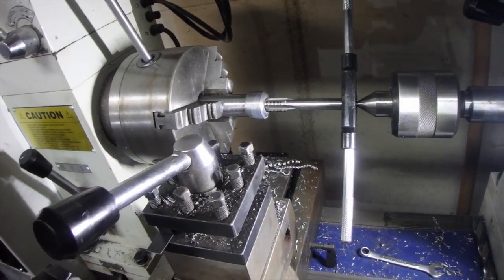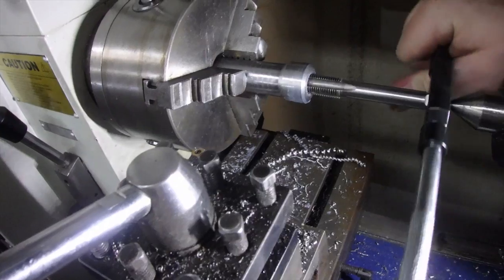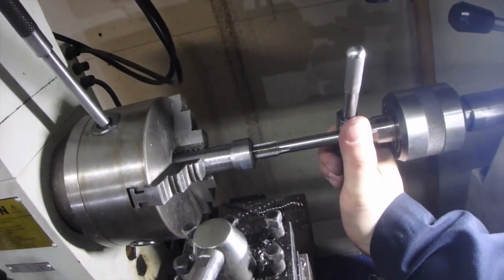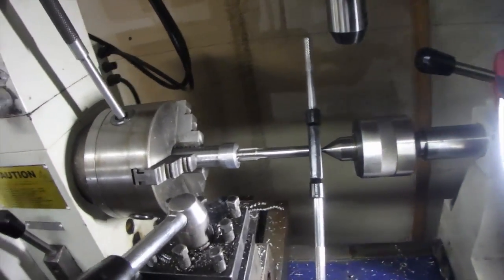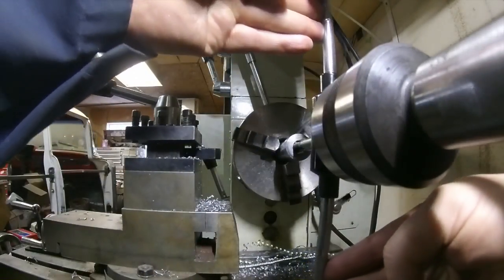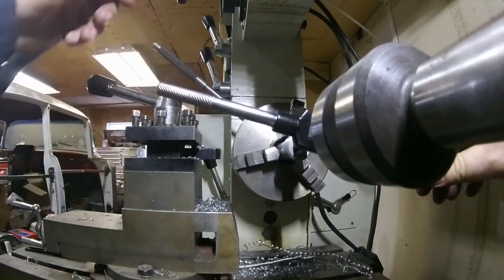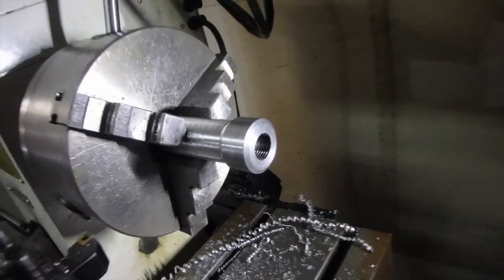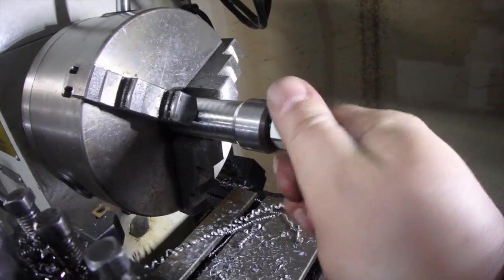It's a little bit on the tight side but I think we're going to make it work. I just got to punch in there and jam it so I can lock the chuck while I spin my tap, but I can't get too crazy because you don't want to bind it and snap it off. Hopefully you can see — I think I got enough thread cut there. Let's see if I can screw that in. Perfect.